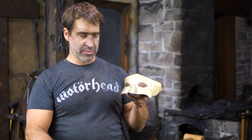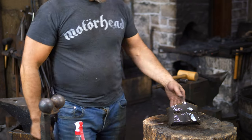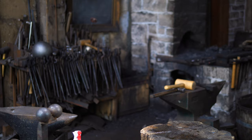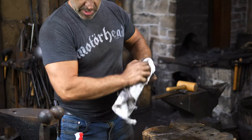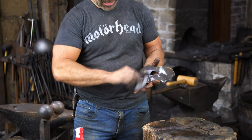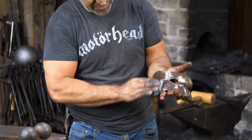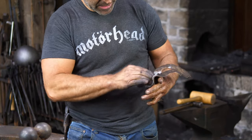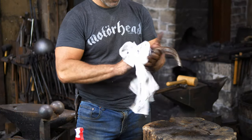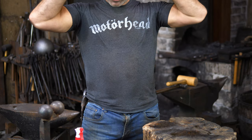I am pleased with the shape. I just want to antique this now, so I'm going to use some black patina — which you use for stained glass — and just spray that on. Let it brown up for a moment, then put it in the slime tub and neutralize it. Dry that off and grab some super fine steel wool to buff out some highlights. I actually like to do the steel wooling while it's still wet — it helps diffuse the surface, leaves it a little less scratchy looking. The black patina pulls out some of the copper hues, so you get those pinky oranges as well as the yellow.